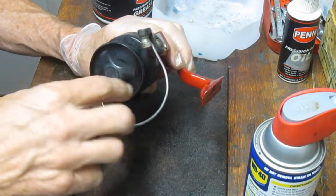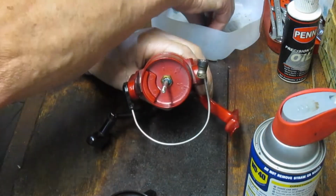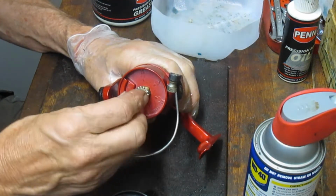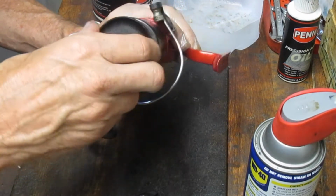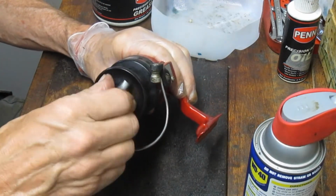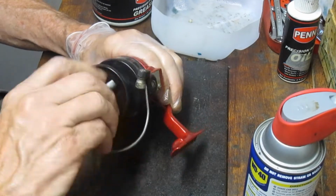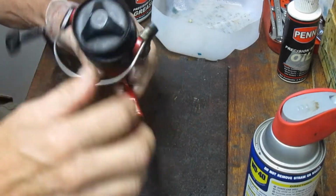Oops. And see, that's where the value of the parts tray goes, because I did an unnecessary step and I pulled the click assembly off, and I pulled the shim washer off, and out of habit I went to put that spool back on, realizing that the click was not installed yet. That click is used for two things. It's spool height, and it tells you when you're spinning in reverse, when the drag is running out. All right, I'm going to tighten that down. There you go, drag's working fully.